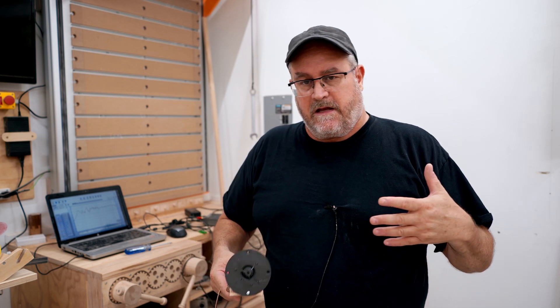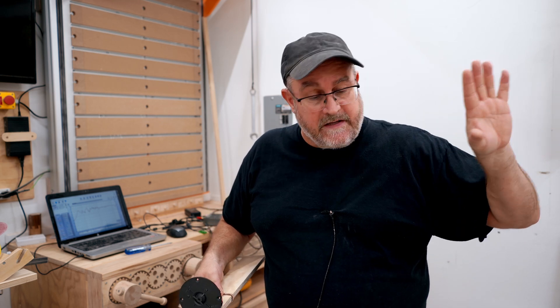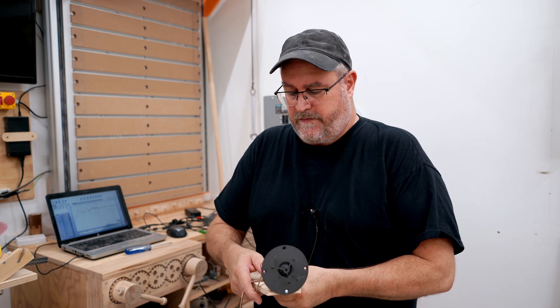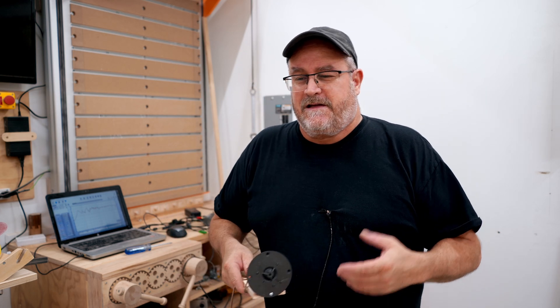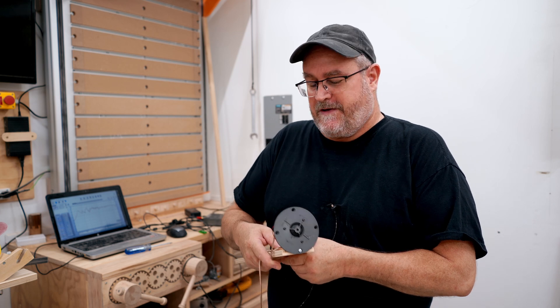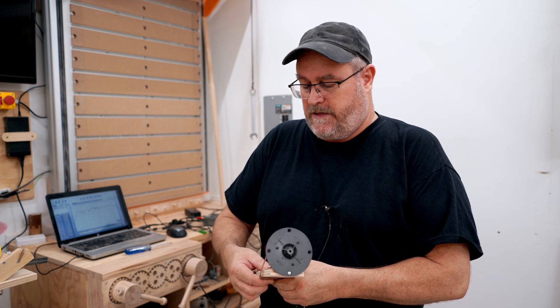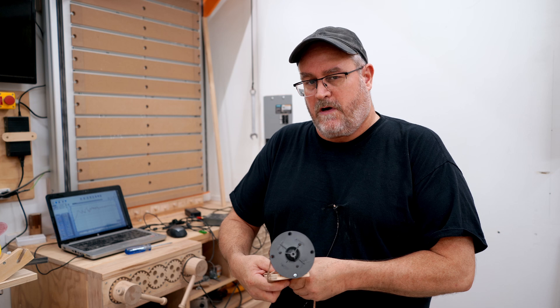What I did consider was adding a rear-facing tweeter to complete the dipole pattern of the open baffle speaker. Currently there's a tweeter facing forward, but there's no high frequency content going backwards, and having a backward-facing tweeter would fix that. I thought about doing that and I'll probably experiment with it in the future. In the meantime, I thought I would mock something up and demonstrate what a super tweeter will do wrong with your speaker.